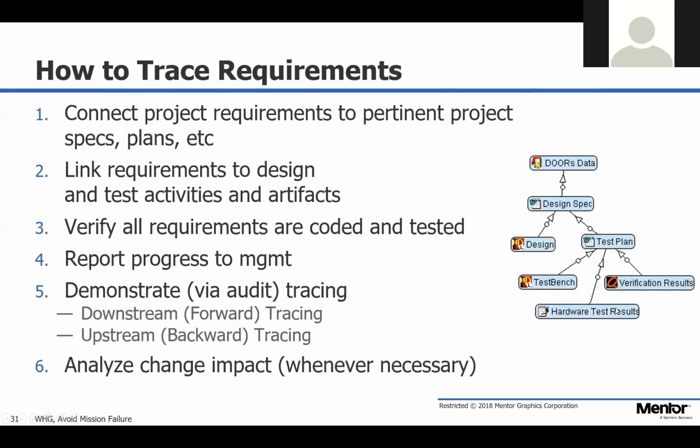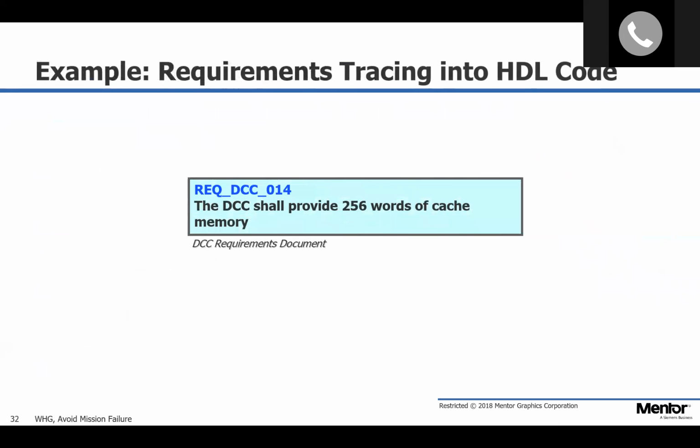Right here are the text logs that come out. So I set up my test bench to not only say this is the test I run to test that, but it also writes out results so that I can verify that that test passed. And then I might also bring in things like my code coverage results. If I have assertions and cover points and cover groups, so SystemVerilog functional coverage objects, I might bring those back as well. And so this is what we do to make sure that this all happens correctly.